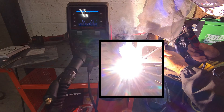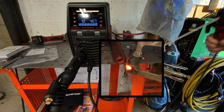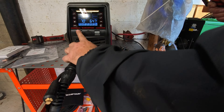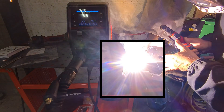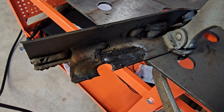Make Jeffro proud! Need a little more, boys. At least we'd have to get Jeffro over here - he is the pro stick welder, I am not. A little too hot boys, let's back her down to 55 - pretty thin stuff. How's that Jeffro? That's pretty thin stuff - I haven't welded stick in a long time.